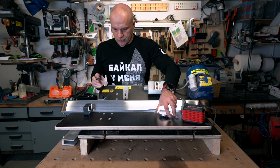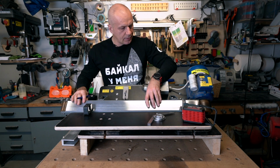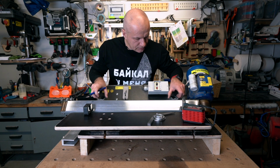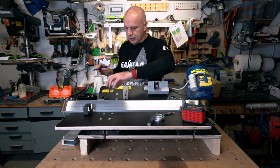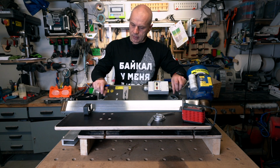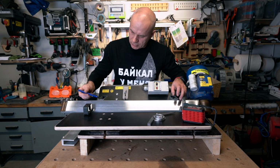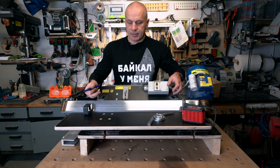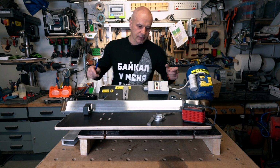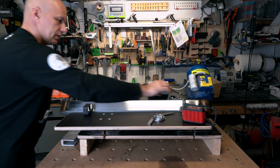I don't know if this was done on purpose or I found it by accident, but the platen is fixed in two positions with this rectangular steel profile attached on both sides with two screws, and by adjusting those screws I can force the platen, by having also a sort of shims or washers on both sides. I can play with it by tightening the screws with a twist of this flat surface, and I will demonstrate in practice how it works. So I know I have this off by a couple of degrees or maybe single degrees.